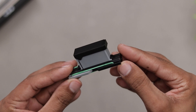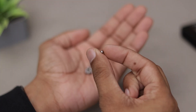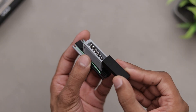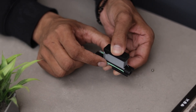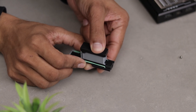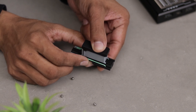I don't have actual BBs, so I'm using these metal balls instead — they're used in bicycles, I guess. I picked them up from a hardware store and they're 4mm in diameter. Now let's load them and see what happens. At first I thought it was working fine, but not quite. Sometimes it fires two bullets instead of one. Now it's not even firing — it's leaking actually. When I tilt the nozzle downwards, the bullets keep dropping without even pulling the trigger.